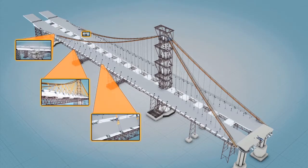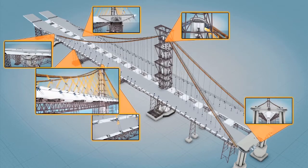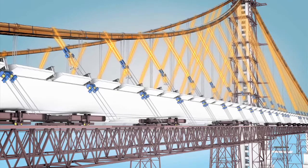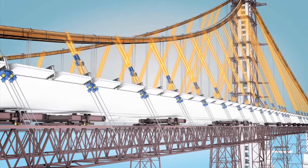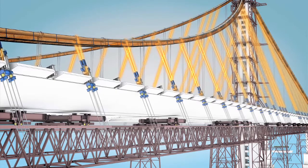So here are the six key areas of load transfer. Watch the main cable here — it actually moved 30 feet down and 16 feet out. It's about 5,000 tons of steel there, and 35,200 tons of steel down here. Massive lift — the largest on our project.